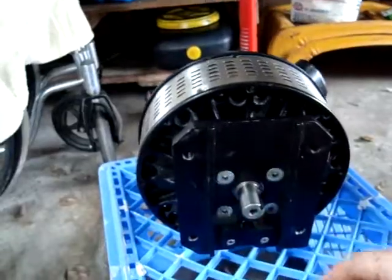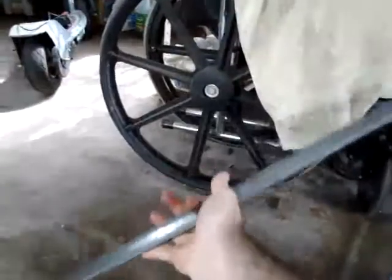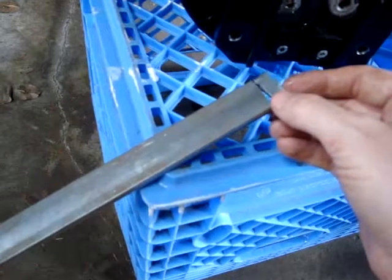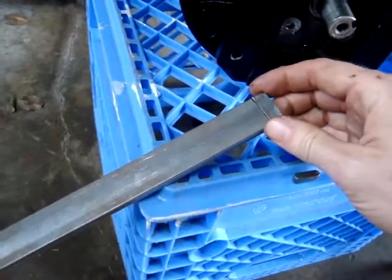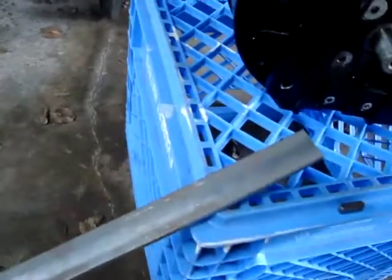I went running around all over town looking and couldn't find one anywhere, so I ended up making one. Here's the keyway I made. I went to Lowe's hardware store and bought a piece of steel — it's a quarter inch by one inch wide by three whole feet long. I told the lady there if she had a little scrap of it I'd buy that, but they didn't, so I had to buy the three-foot piece just to cut off a little three-eighths-of-an-inch-long piece. All the keyways they had at the hardware stores were square shaped — none of them are rectangular.